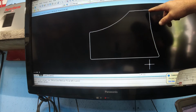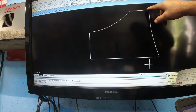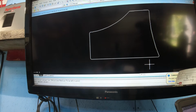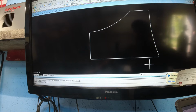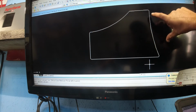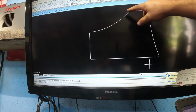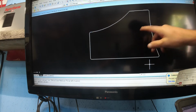And here at the top, I raised it about an 1/8 of an inch. And then I came down, so that's sloped just a little. It's probably going to still have a little bit of a gap, but that's fine. It shouldn't be too bad. It'll probably be a little snug. I might even have to touch it up with a grinder to get it to fit a little nicer on here, because if it rubs here, it's going to mess up this arc on the blade. So I really don't want it touching, because I can weld that with 7018.